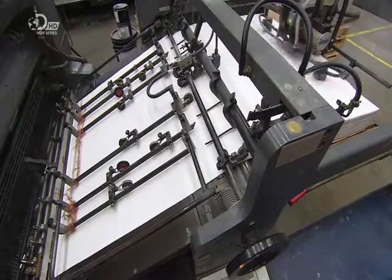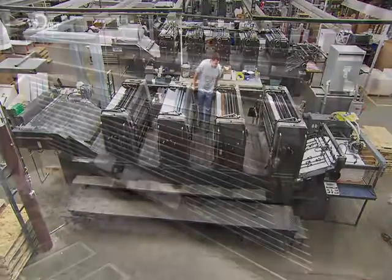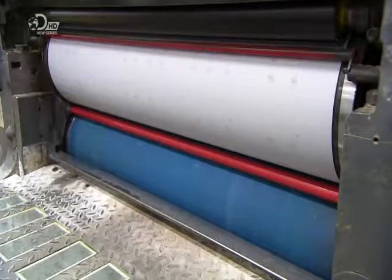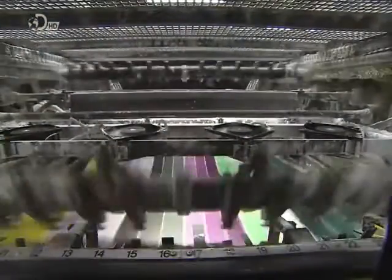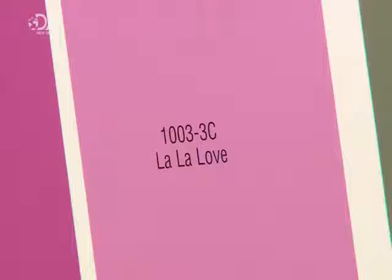It's a 4-station printing press. Each cylinder is equipped with an ink of a different colour to stand out against the various paint card stripes. They print the paint colour names and numbers on both sides. They also apply varnish to the back of the sheets, so the paint chip cards won't stick to one another when they're stacked. Named and numbered, the colour stripes are now all identifiable.